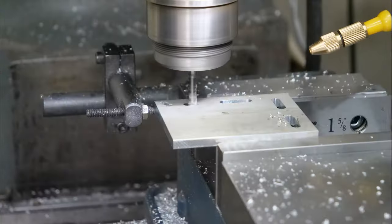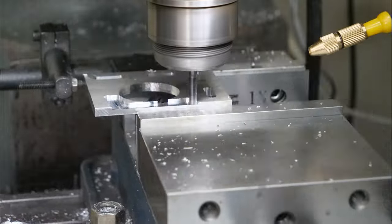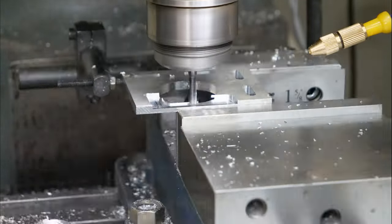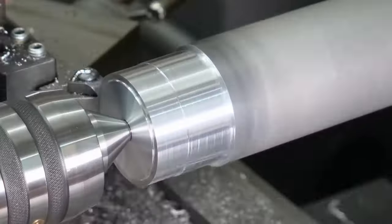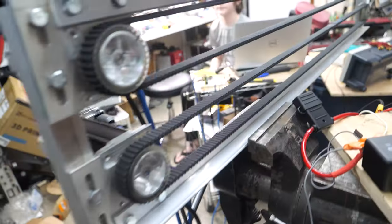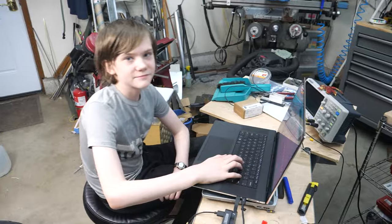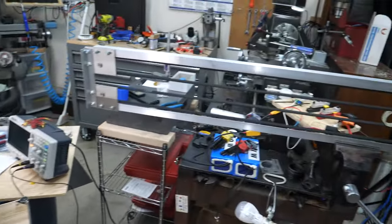But linking two high-performance motors together requires a sturdy metal frame. And because it's a prototype, we want to carve slots everywhere to allow for adjustments when tuning. We're also machining our own custom lightweight pulley hubs and 3D printing the teeth, since everything the motors move needs to be as light as possible. All right, let her rip.